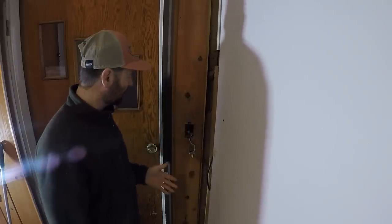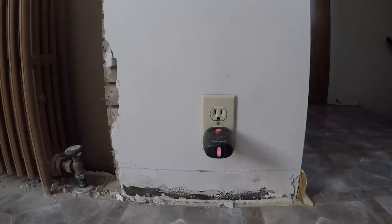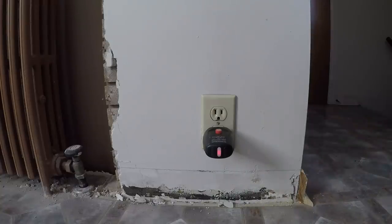I got a new tool. I don't know if it's going to work on this old electric, but what I'm going to do is see if I can shut the circuit off. I had some success with this in a recent house where I replaced all the plugs and switches in the entire house — I would just go to a new area, plug this in, then go out to the panel with this and find the breaker, turn it off, do what I had to do, then turn it back on. So this is the electrical panel — original to the house, really old. The new circuits I run for this kitchen are not going to this panel; they're going to a new panel in the basement.